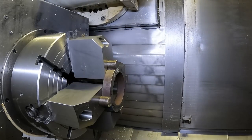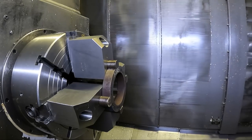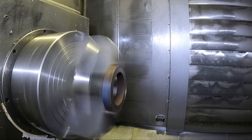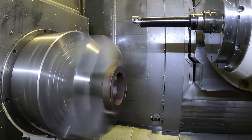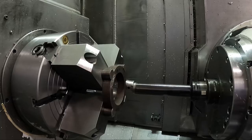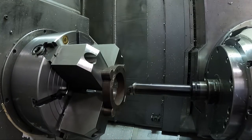I think I've got everything right here - I think I've changed all the offsets. I was running that little vice fixture before, so it might be wise to be careful here. We're in this Sandvik silent bar with a CNMG 432 insert. I forgot to make a setting in the appropriate offset. This is where I want to slow down - it should be sitting two inches out in Z. I'm going to come down in single block and check the insert on this tool. It doesn't look too bad - I don't know what grade that insert is, it might not be perfect for this, but we're going to go with it.